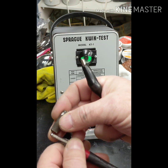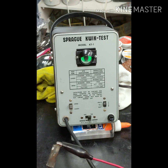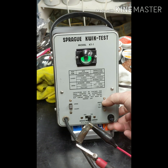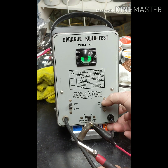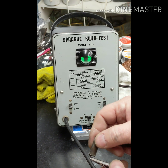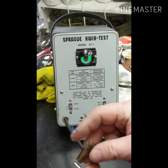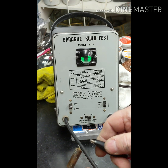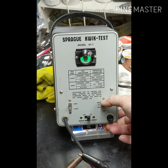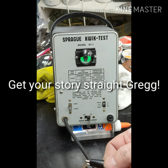Here's another old one - might have even pulled it out of this unit. We're on the open setting and it's not closing. It is moving, it's attempting to close, but just barely. Since we're on open and it remains open, this capacitor is open. Just for giggles, let's put it on the short test - and it closes when testing for short. But it was open on the open test - so this one is open.